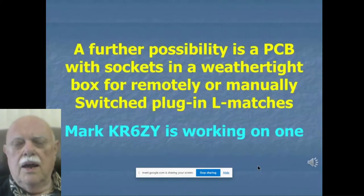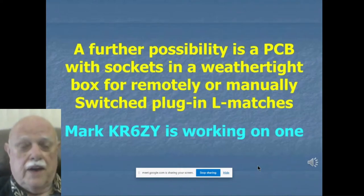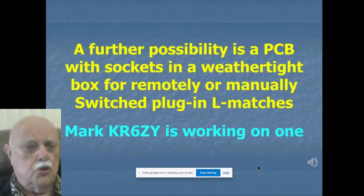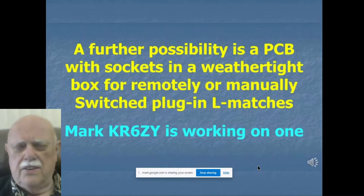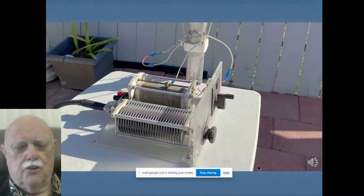Now, if you don't want to invest in one of the high-cost auto tuners, and believe me, you don't have to, you can't use a tuner in your shack. That's an absolute no-no, because that'll put a long piece of coax between your shack and this antenna. This antenna is a high impedance, non-resonant antenna. And when you put a high impedance, non-resonant antenna on the end of a piece of coax, you've got high SWR. Coax hates SWR. The losses become terrible.